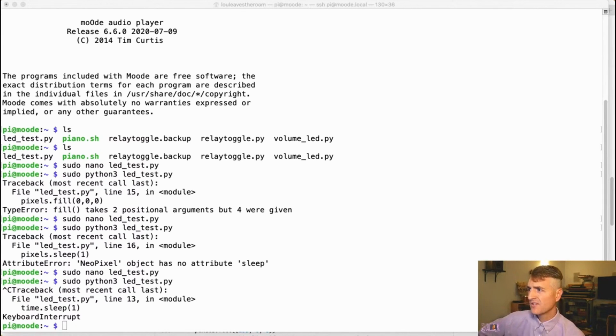I've messed around with software volume, and one of the problems I'm having is that in order to keep the amplifier at a maximal level, it just amplifies all the noise to a maximal level, so then your signal-to-noise ratio goes terrible, and basically what that equals is hiss in your speakers at all times, which is unacceptable. That's not how a real system would operate. Unless you're doing an arena rock show. I'm generally not doing arena rock shows in my driveway.